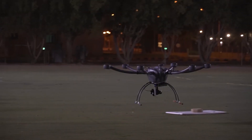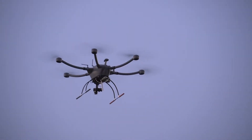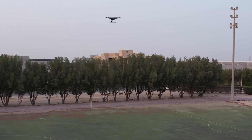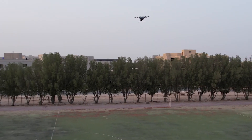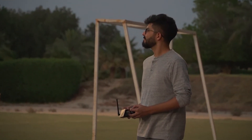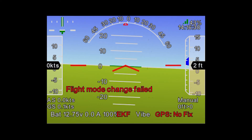During this year's January to June timeframe, we conducted more than 30 flights with over 200 minutes total flight time. For the most part, we used ArduPilot to conduct the missions, and we only used manual mode when something unexpected happened during our autonomous flights. Takeoff and landing were done either with ArduPilot or by using MAVLink directly via Python's PyMAVLink library.